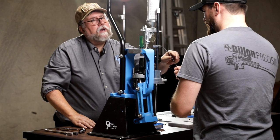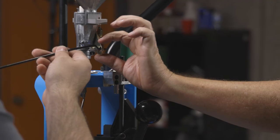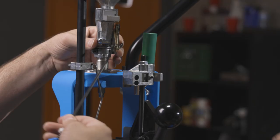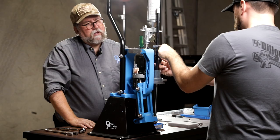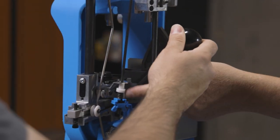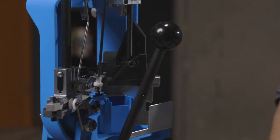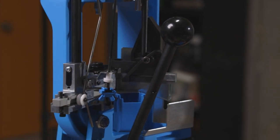So when you put that on, it goes in through the oval hole in the back, it comes out the round hole in the front plate. And then pivot it around so it just drops down. So pivot that around, right? Drop it down. And now pull the handle down just a little bit. Okay. And that in there. Now lift up on the handle, and this white bushing snaps up inside of here. We will adjust the height of this blue wing nut and this bushing a little later. Oh, okay, cool. So the wing nut here, you adjust it to elevate it. Okay. All right, we got that on.